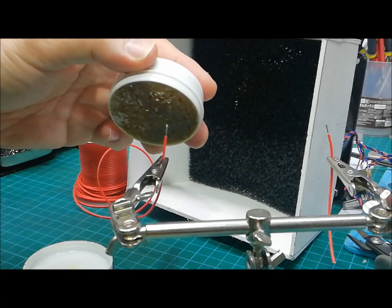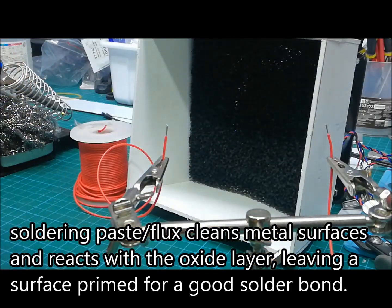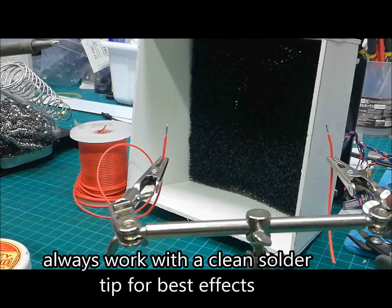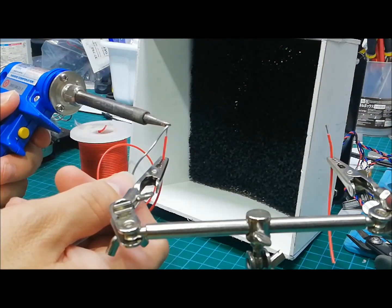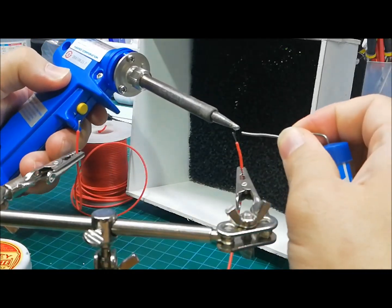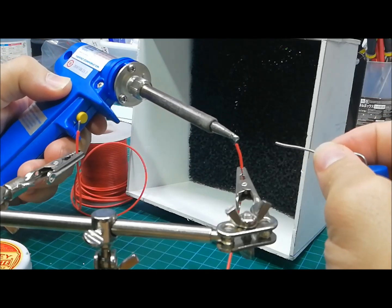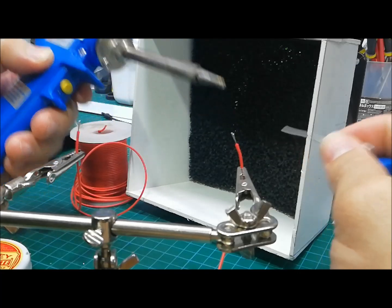So what I'm going to do is put a little bit of soldering paste, like so, and apply the solder. I'm just going to clean this up. You can see the solder — the tin — is flowing into the wires. Same with this — you can see it's flowing. So now the entire length of the exposed wire is coated with solder, or tin.